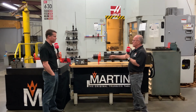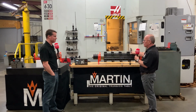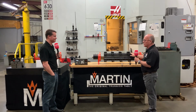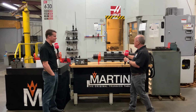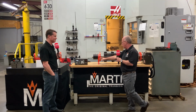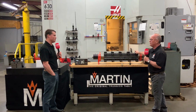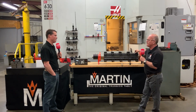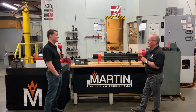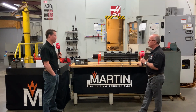Mm-hmm. Because a lot of people think that it's difficult to program a one-off part with a tombstone or triangle, whatever, but it's really not once you get used to it. But because of that, a lot of people want to put just a vise at the end of the setup that we have here on the table. Yeah, I can imagine the comfort zone tells us we still need our original setup somewhere in the machine, and this is going to be for something special. But to your point, once you're comfortable with this, you can do a one-off on this as well.